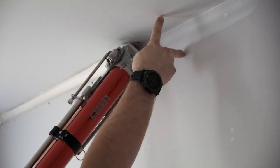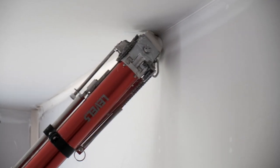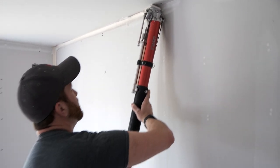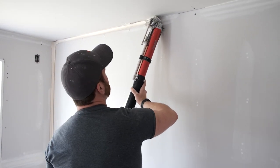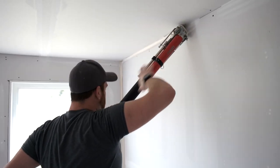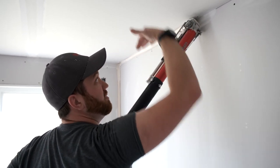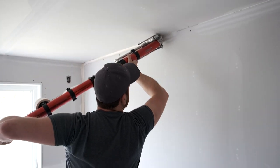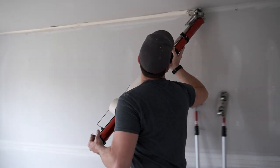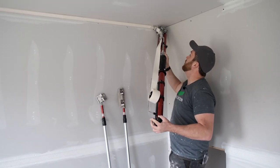Another thing when you're taping angles: if you look at the top, you want to make sure that both your wheels are touching that inside corner. You don't want to be taping off to the side — your tape will go all sideways on you. You want to keep it perfectly level. You can see I have the taper at an angle to my body; these are fairly low ceilings. If the ceilings were higher, you'd probably have to tilt your taper even higher up the wall.